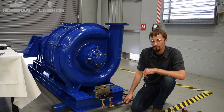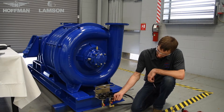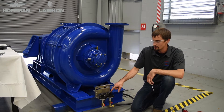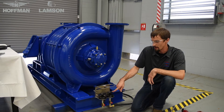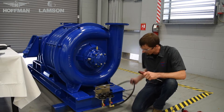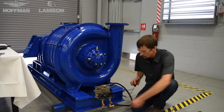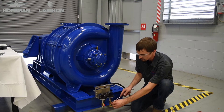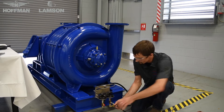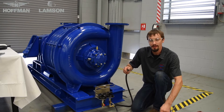Once you have installed the hose to the bottom of the bracket, it is now time to purge the line full of grease. In order to do so, you must first rotate the valve on the bottom of the bracket. If you do not rotate this valve, it will allow grease to pass through the top of the bracket where your lubricator mounts, and we don't need grease going there — we just need it to come out the end of this hose. Remove the protective covers over the grease fittings, attach the grease gun, and begin pumping the line with grease.